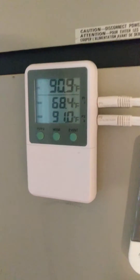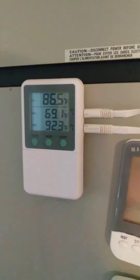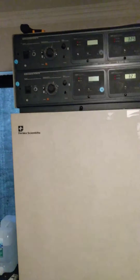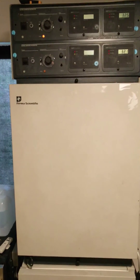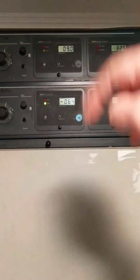The certified temperature setup gives you a high, a low, and a max reading, and it has two temperature probes in there right now. The temps will be off right now because I just started this incubator back up — it needs to settle for 24 hours before I put anything in it or start adjusting it. What's also really cool is it has accessory plugs on the back on each side, and you can add a rapid humidity recovery system — so when you open the door and you're trying to keep 80–90% humidity, it recognizes when you shut the door and rapidly recovers the humidity. It also has CO2 monitoring if you wanted to run a CO2 injection system.